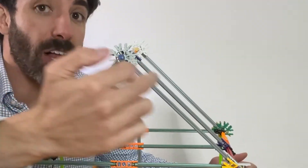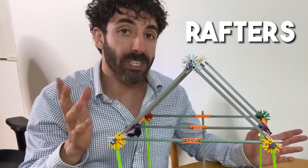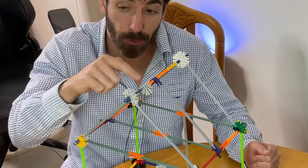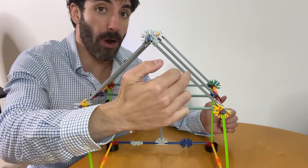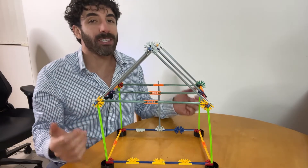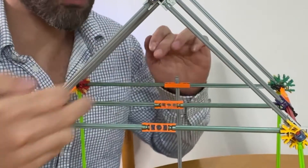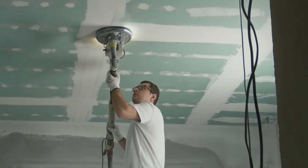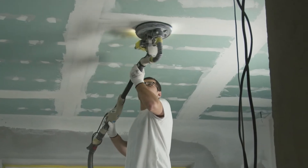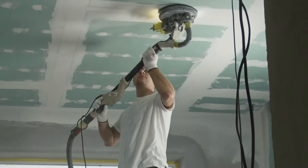The gray inclined sticks that extend from the ridge to the eaves represent the rafters. The sticks at the ridge represent the ridge board, which is only a connecting point for the rafters — it's not a beam supporting the rafters because it doesn't have supports itself. The green horizontal sticks represent the ceiling joists, which perform a double role of supporting the plasterboard ceiling and holding the roof together.